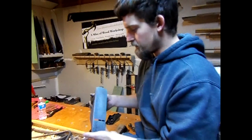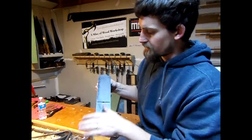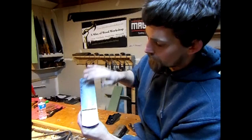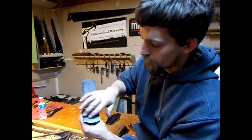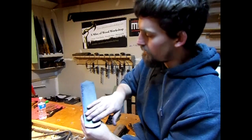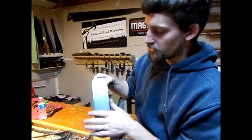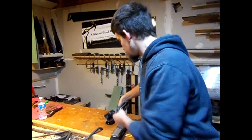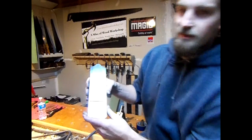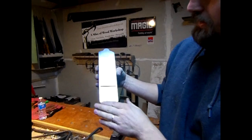After I got done with the 500 grit, I wiped it up, put some water on a rag and wiped it down. As you can see, it's very pitted — the rust spots were a little deeper than I originally imagined. But all the lines are coming off with the same number of strokes, so it's completely flat. Just to give you a different perspective, here is another No. 4 that I was redoing, and you can see that one is a lot better — no real pitting in it.